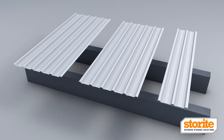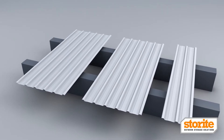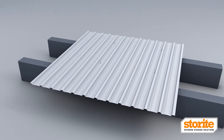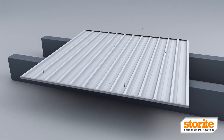Lay out the roof sheets on a flat surface along with the U-channels and L-flashings. As with the back wall, join the sheets together with two fixings, then cap the sheeting with the U-channels. Fix the channels at every second rib but not the corners at this stage.